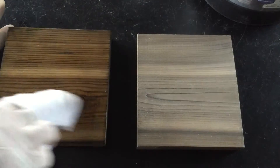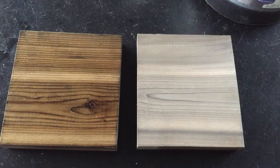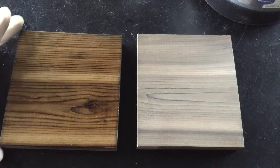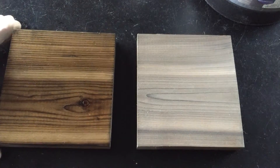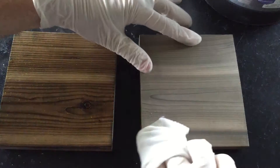After I apply it, I'll let it impregnate the wood, and I'll come back in about five minutes and take a clean rag to take anything that's left off the surface, rub it down, and then let's see it on our Reclamation.